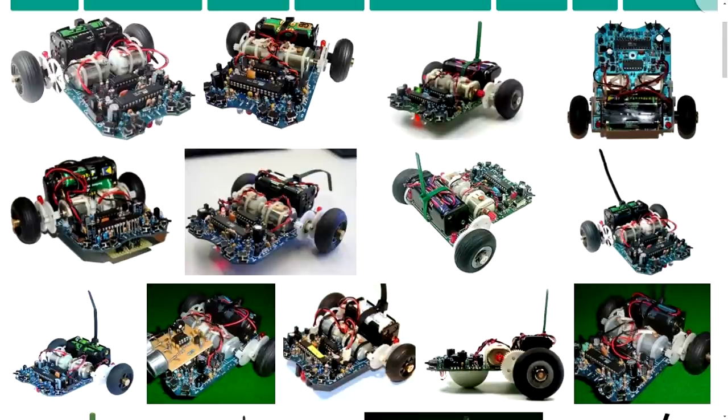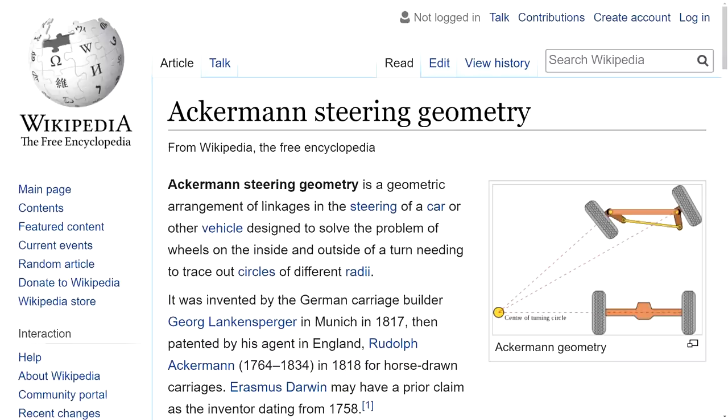And the thing with that is that when using Ackermann steering, you have four different turning radii or circles and two different steering angles. That means that all of these four wheels are basically rotating at a different angular velocity. So what you would have to do is to keep two of the steering wheels just in parallel with the frame here, then steer with two of the others with two different angles, and then drive the four motors at four different speeds.